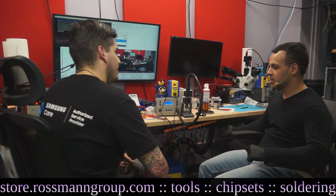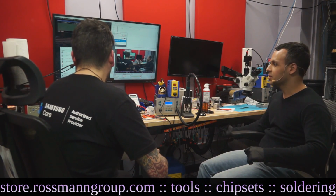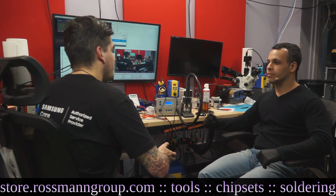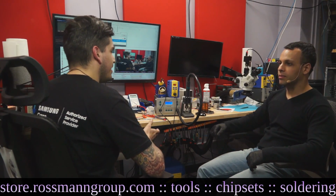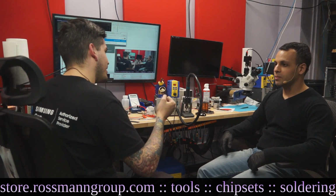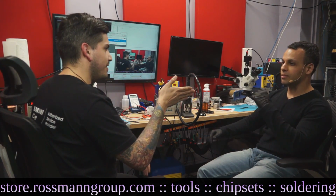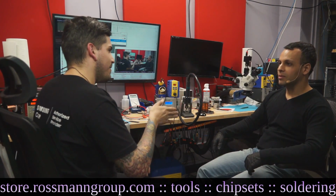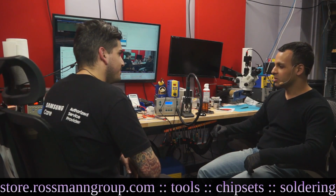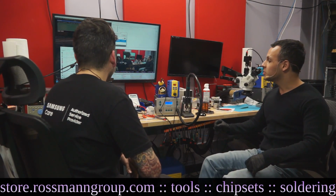And try to find the lazy way out, because running the wire under the chip is very hard. So I just look for the lazy way out. I thought it would have been a lot easier because I was like, all right, this enameled wire, I don't think it'll be an issue if I run it around this ball. And then, I swear, the instant I put heat to it, I just watched that wire straighten itself out and bridge 2 balls. And there's nothing worse than 2 balls and a wire running through it. I try to avoid running jumpers under chips whenever possible because it's no fun.